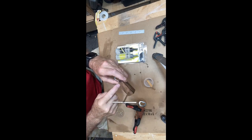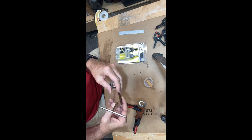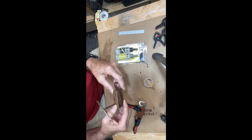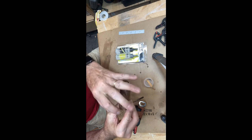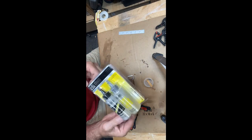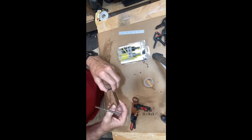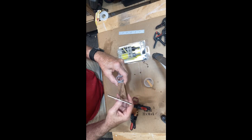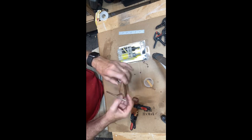I used wood glue last night on the piece that has an inlay and let it harden overnight, so there's a nice bond between the inlay and the koa wood. I orient the inlay so the curve is continuous within the handle on both sides. The epoxy I use is a BSI slow cure — it's a 30-minute epoxy. It takes about 30 minutes to cure but a couple hours to be completely dry and sandable. I'll go ahead and add the epoxy to these and let them sit for a few hours.